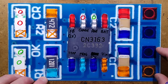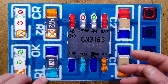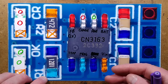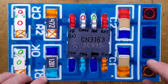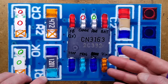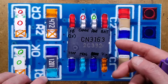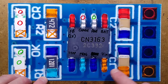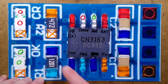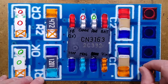So what do we have? We have the input here from the solar panel. Worth mentioning, most of the solar panels you find for charging lithium cells are 6 volt - they've got 12 silicon sections. This doesn't need a diode, but it also has a maximum input voltage rating of 6 volts. You'd want something like a 10-section solar panel putting out around 5 volts to avoid going too high. The solar panel feeds the voltage input pin and also that resistor for the two LEDs - charging and charged - and the output goes to the lithium cell with its own decoupling capacitor.